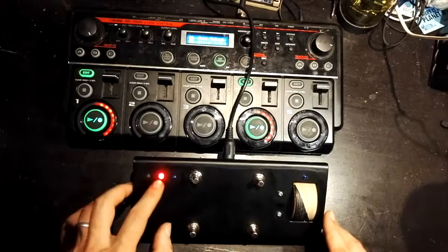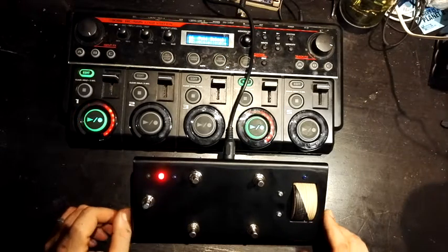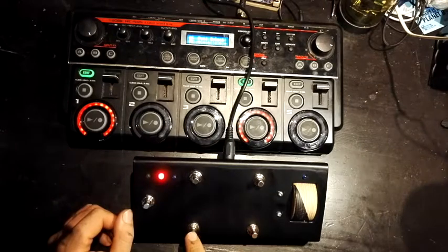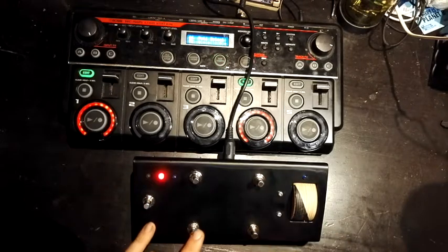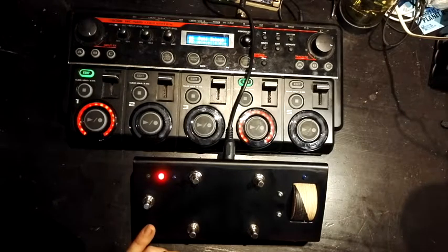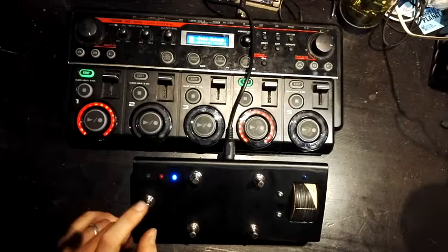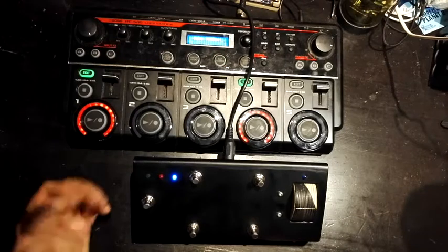If I turn the wheel and go to the red mode, I will now have the stops. I can stop track 1 and stop track 4. This is the way I set it. 1, 2, 3, 4, 5, 6, 7, 8, 9, 10. So the command change 9 is stop track 4. Then I've got on blue, if I turn the wheel again, this button is undo. The last thing recorded can now be undone or redone.